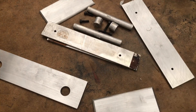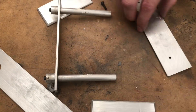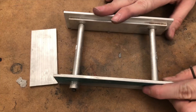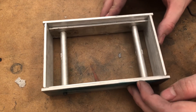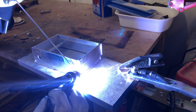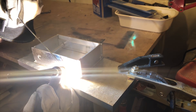Now it's time to assemble the jig for welding. The idea of the jig is to line up the holes on the top and bottom plate and keep the sides nice and square. The welding process can now begin. I start by tacking all the corners and then work down the two long sides. I feel compelled to state that I am by no means an expert when it comes to welding — I have only been doing this for about two weeks, and I'm sure my technique has at least one expert bashing on this keyboard.